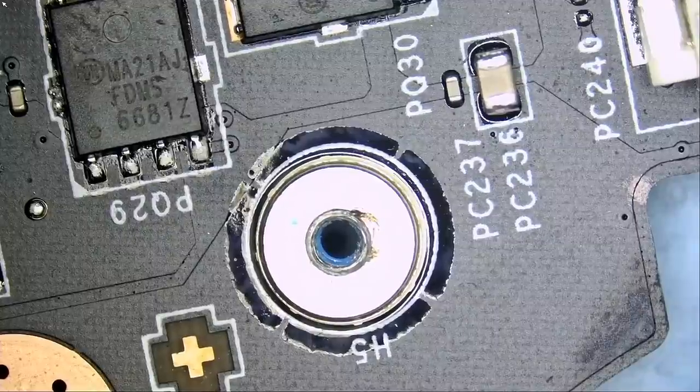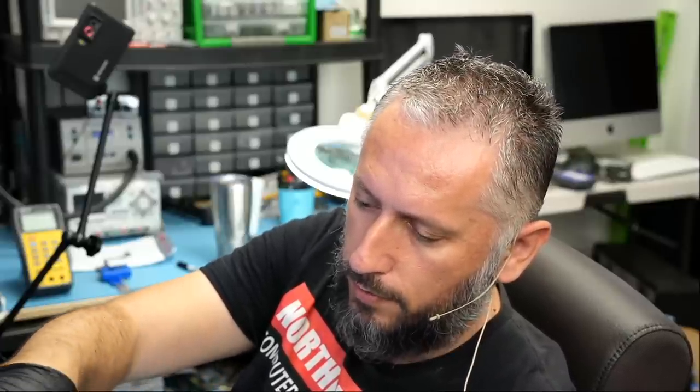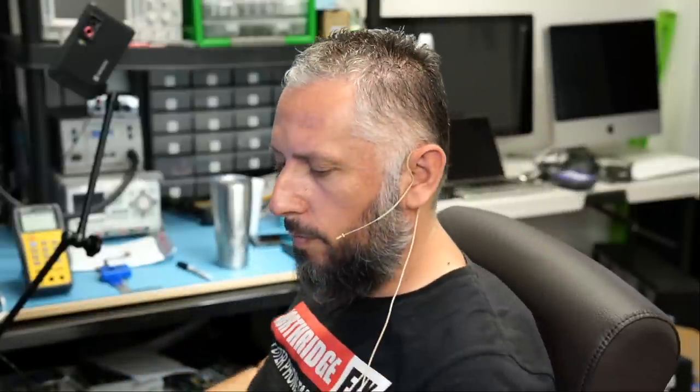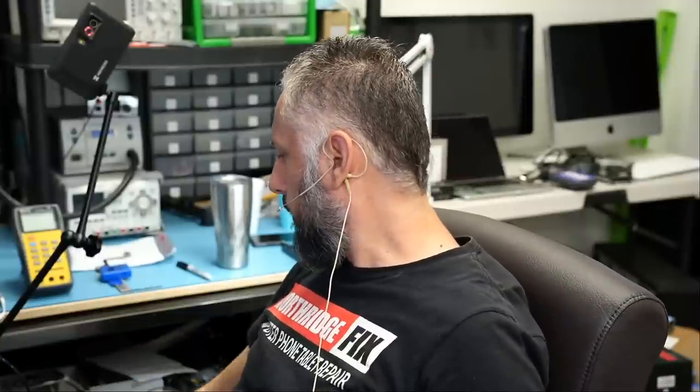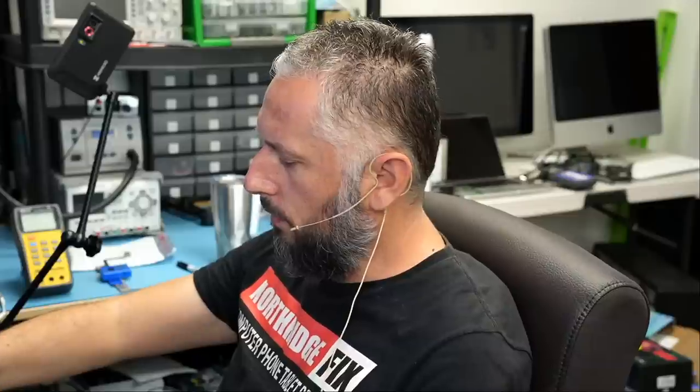I would say 70-80% of the times we are able to fix short circuit related problems, and other times the repair may be non-practical or non-economical to fix. Such as if the problem is CPU related, PCH related, GPU related, then we deem the device a no-fix. So what we're gonna do is inject voltage onto that shorted current sense resistor, monitor the board under a thermal camera, and see what gets hot. Easy, right?